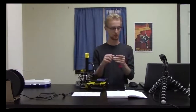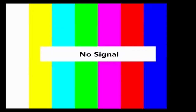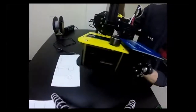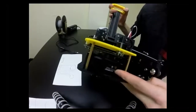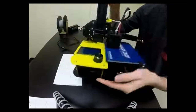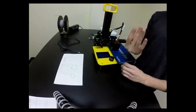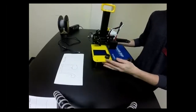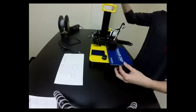Once you take the SD card — that small micro SD card — it inserts into your printer below the button. I'll swap cameras to show you: it's right underneath here, that's where you'd insert the SD card. It's just a really tiny small port that it slides into. That would be all of step three — just the transfer to the printer. The fourth step would be to click the printer and tell it to print, as long as you have everything prepared.